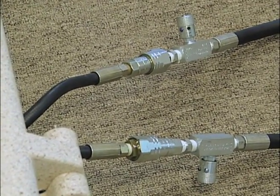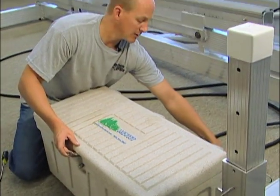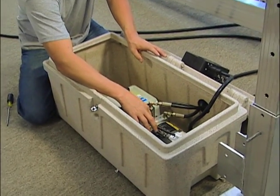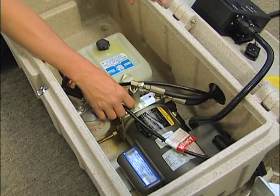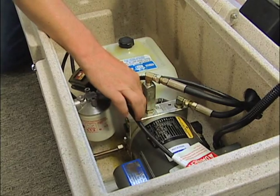If it's a little under pressure, it'll have a little restriction and the valves may not be fully open. The other thing to check is the valve on the pump — make sure that it is open. If it's closed all the way, back it off about one and a half turns.